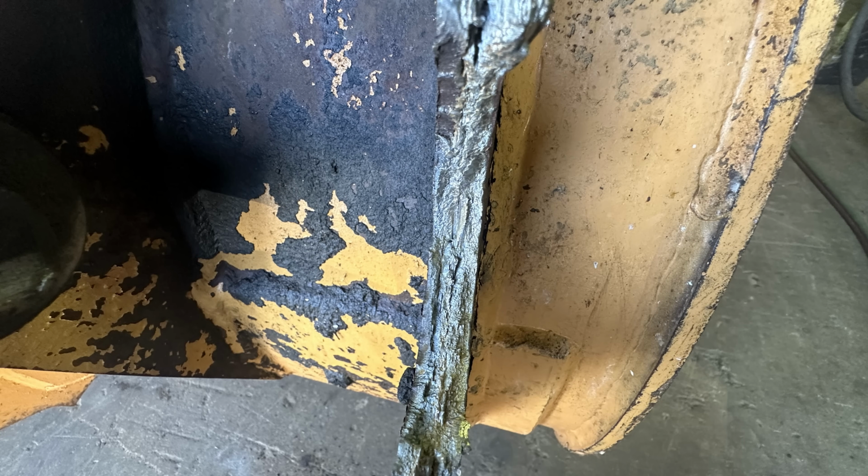Here's a close-up of that material, and you can see how poor it is. I mean, you would not want to just try and weld something to this, because you know 1/4 inch into that it's still all fatigued and cracked. Now, an interesting question you could ask yourself with this material is, is it actually mild steel? Now, I ended up welding this with mild steel 1/2 inch plate, and I'm not entirely convinced that this wasn't some form of, not necessarily heat treated, but something like an AR300 or something similar. Like, it's not AR500, but it didn't seem to me to be mild steel.